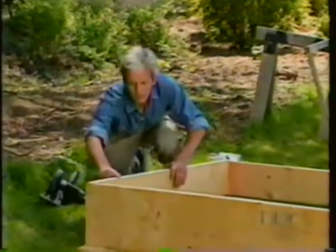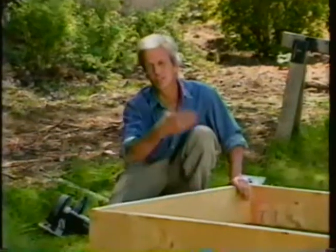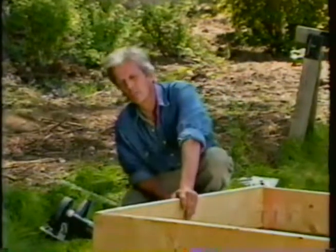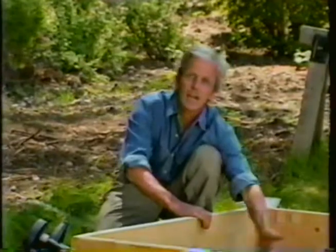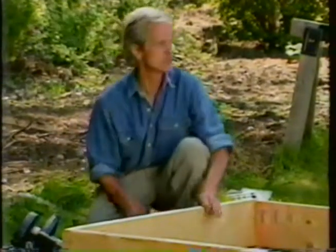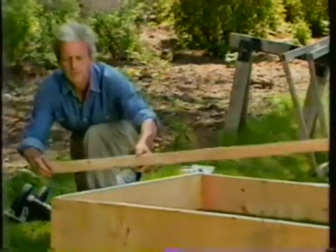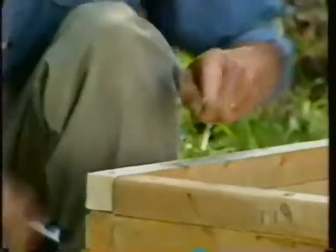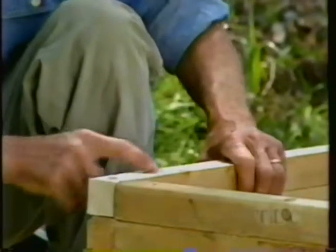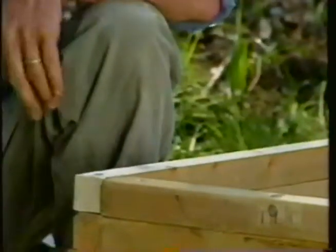We've built this box upside down for a very good reason. This bottom edge has the angled cut I made with a skill saw to match from twelve to eight inches — it isn't perfect, but it doesn't need to be, because it's actually going to be on the downside. Now, the one thing everybody wonders about is whether this will rot in contact with fertile soil. Yes, it will. I don't want to use wood preservative near my vegetables, so I use a sacrificial strip — a piece of waste two-by-two put on top here. These strips are what will be in contact with the fertile soil, and after four or five years when they rot out, I just take them off, put new ones on, and the rest of the frame, held in the air by them, is protected.